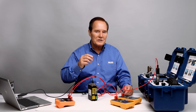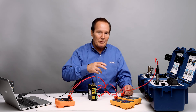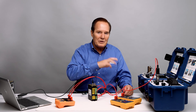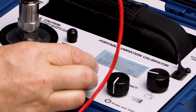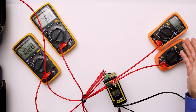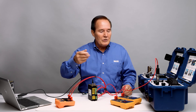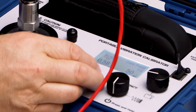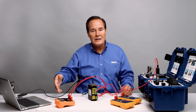Starting with channel one, I'm going to increase its vibration level to 0.4. The alert should come in and we should see the relay change state. I increased the level to 0.4 and the relay came in — you can see the relay change state, it's at zero ohms now, so we have a short circuit and the relay shut. Now we're going to go up to 0.6. And we now have a danger relay — you can see that we have a short again because the relay shut again.